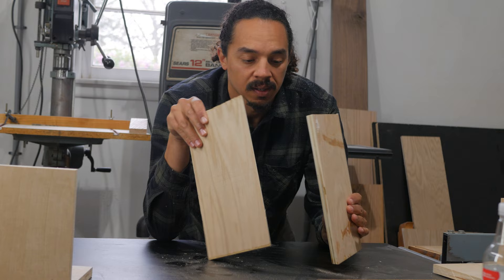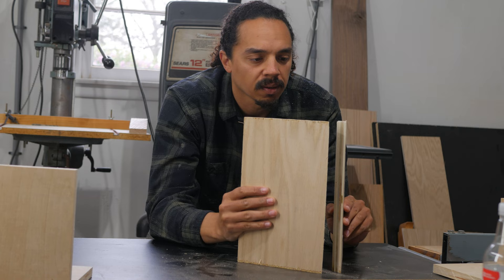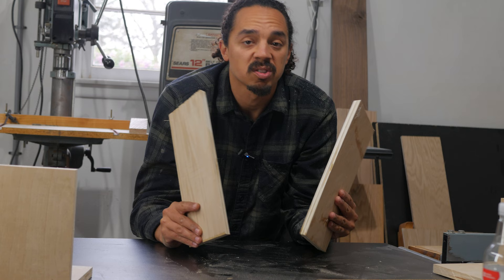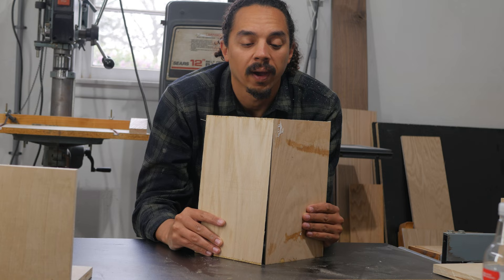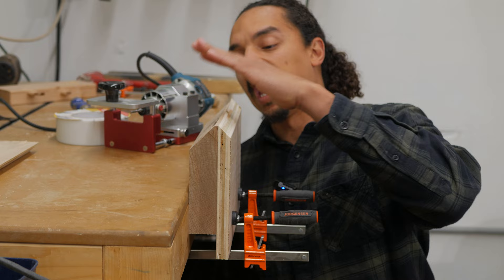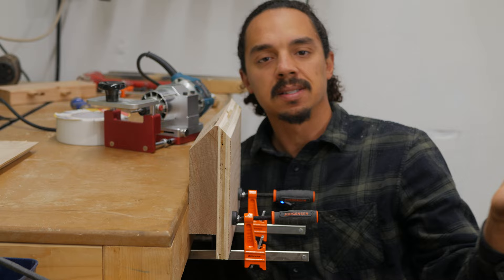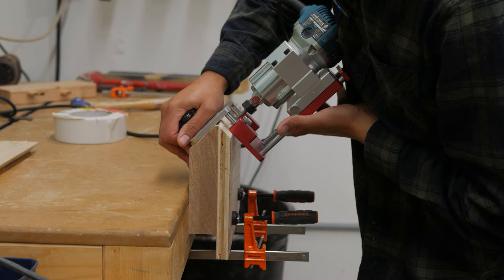This next one is going to be pretty difficult — we'll be doing a miter bevel. You're trying to make a box with edges that flow all the way down and around, and you want to reinforce them with some diagonals. What makes this challenging is my jig does not have an adjustable fence — it's stuck at 90 degrees. So we're going to have to figure out another way to make a 45-degree cut. Here's the trick: I have a nice fat piece of wood that I cut at 45 degrees, and behind it is another 45. Together, that acts as a 90, so I have something to reference my top fence on.